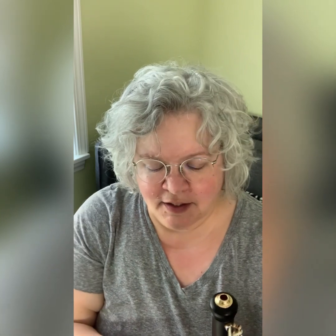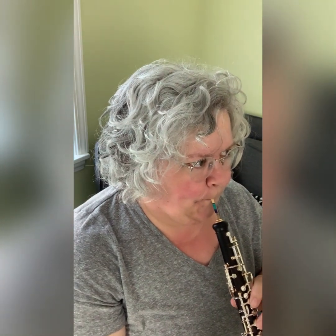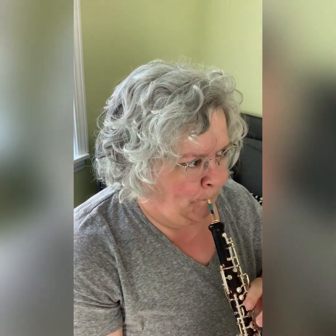Here it is a few minutes later. I just messed with the angle of the blend on one side of one blade, and I've already gotten much closer. So already that starts — I wish it was a little clearer — and it's super stable. There's none of that weird pitch-bending thing. I didn't clip it, I just cleaned up that transition between the blend and the heart in only one small area.